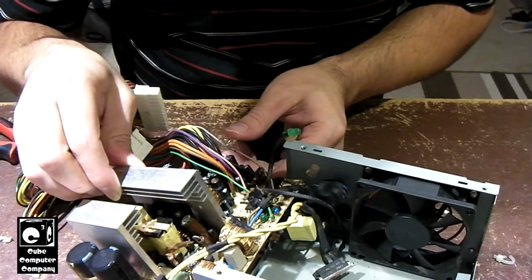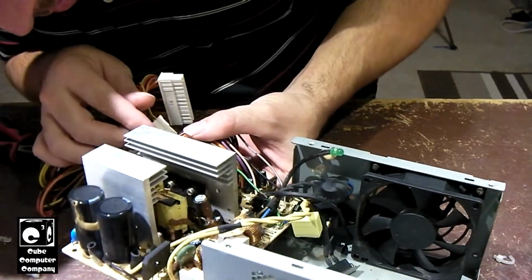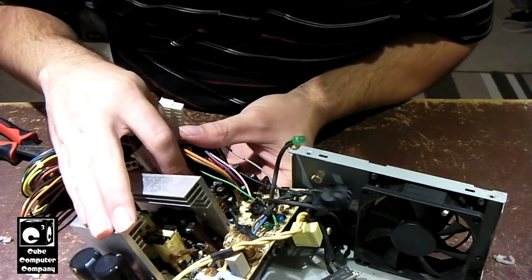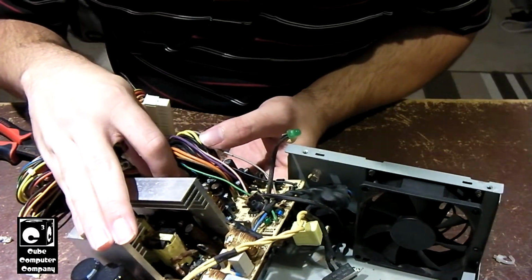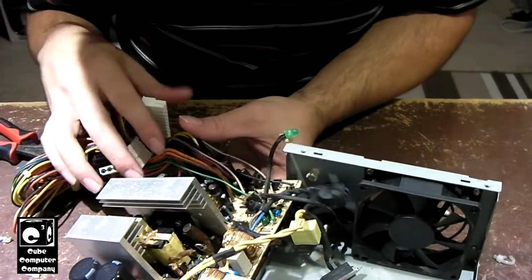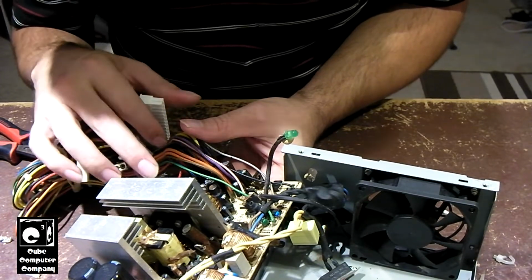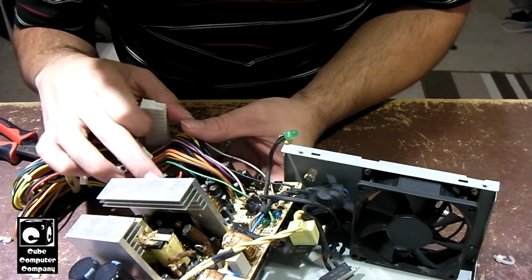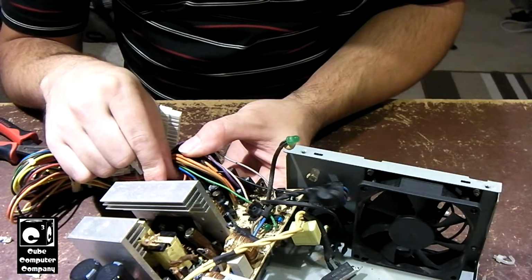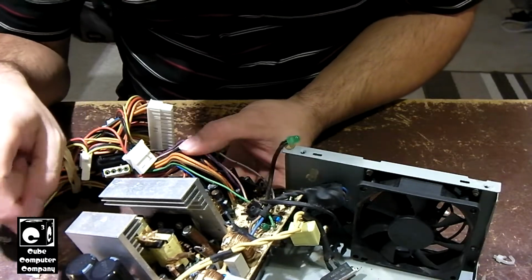Looks like even the coil has some on it that's gotten hot. I'm going to be really careful trying to clean the coil up though, because I don't want to scrape the varnish off of the windings. Though I just might have a coil from another Bestec unit that might fit right on this thing, because I think I did save some coils off some old Bestec ATX-300-12Z units that I scrapped years ago.